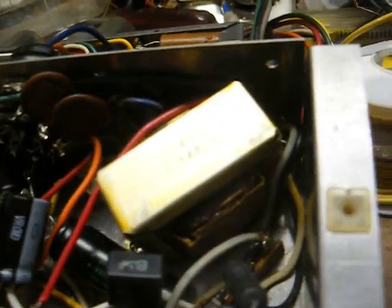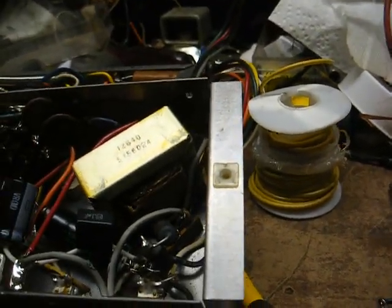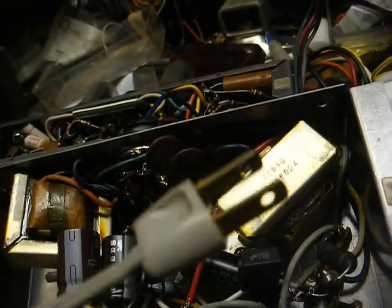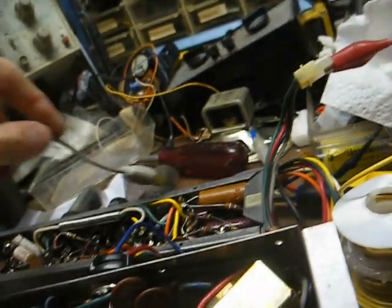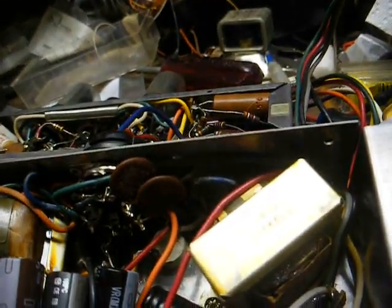It was a little bit out of tolerance, and it's only going to go up, so we went ahead and replaced it. However, we're still not out of the woods. I have our switch contacts jumped on the record changer plug, and I measured resistance across my power plug, and I should get a resistance of the tube string here, the filament string, and I'm not getting that, so let's see what we got here.